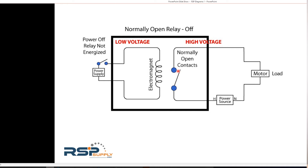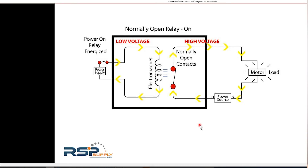When those contacts touch one another, they allow power to pass through them. A relay consists of two separate circuits that work together to open or close a switch. The first circuit drives the coil or electromagnet — electricity passes through the coil and creates a magnetic field. The second circuit contains a set of contacts and a separate power source, providing power to the electrical load. When electricity passes through the coil, it creates a magnetic field that pulls the contact from the other circuit closed, allowing current to pass through the contacts and energizing the load.